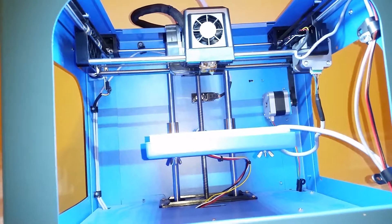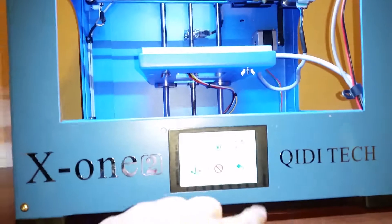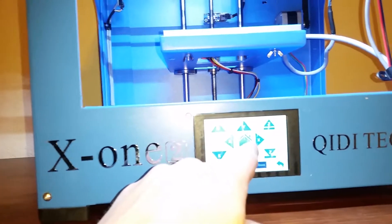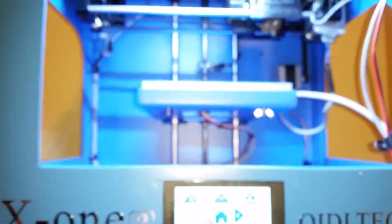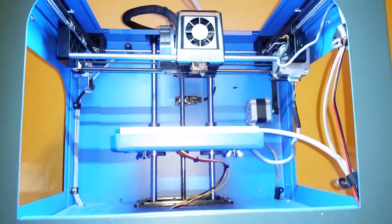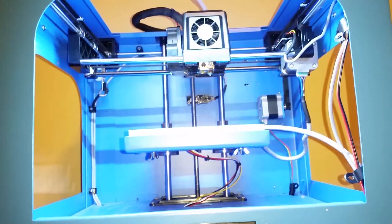Machine is booting up with everything back in its normal position; the cables are still loose inside the case so we don't reassemble prematurely. Going into Tools > Manual — let's try the x-axis and y-axis. There was an accidental home button press which should have triggered the limit switch and stopped — not sure why it didn't. Let's make sure we just press X this time. X is working.